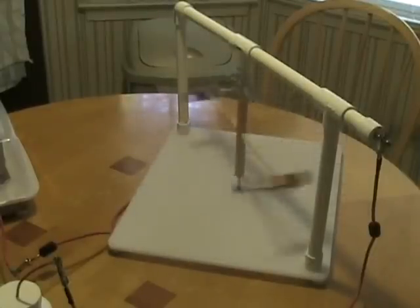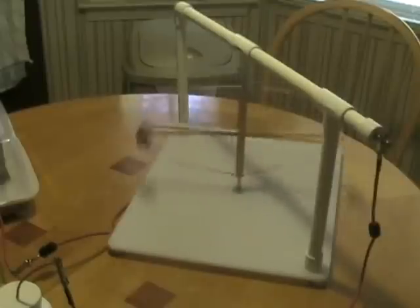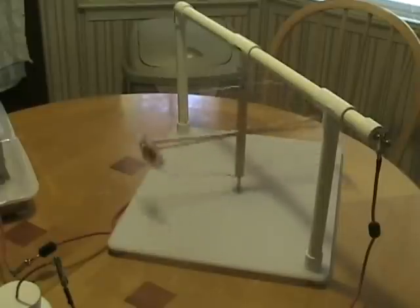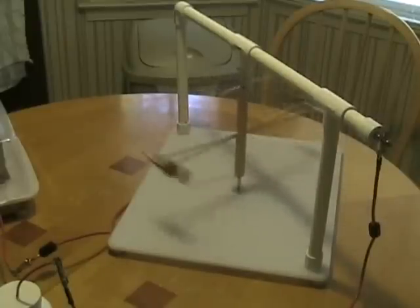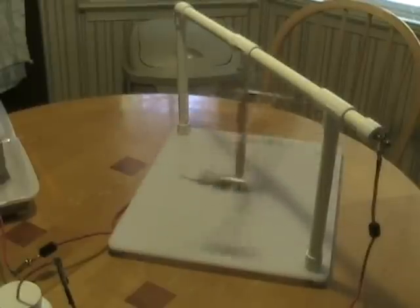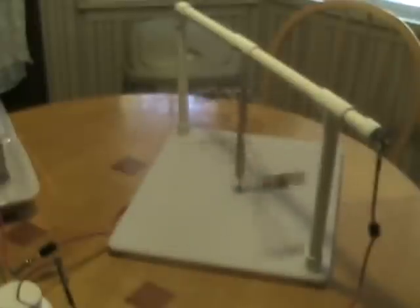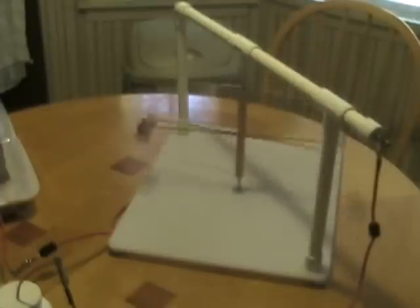The loud hum is coming from the microwave oven transformer. I will increase the power a little more — that is about three quarters power, and it's spinning quite fast now. Remember that even at the maximum setting this microwave oven transformer only puts out about 2,000 volts. The amperage is fairly high, being designed to power a microwave oven, but the Cockroft-Walton multiplier only has five stages so it only increases it by about five times.